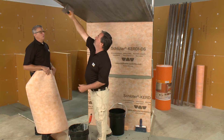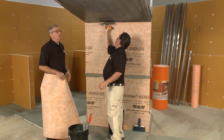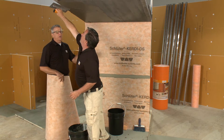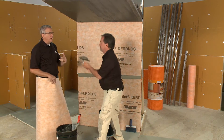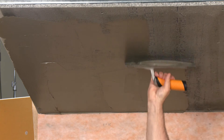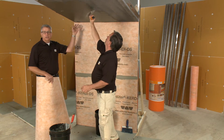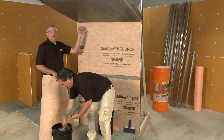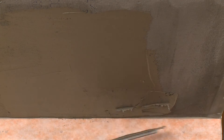It's always a good idea to use the flat side of the trowel first to really get a good bond to the substrate — burning the thinset into the substrate is good tile-setting practice, and it's very important here on a ceiling. When you get the thinset applied, whether it's a wall or ceiling, the last thing you do is turn the trowel around to the notch side and gauge how much you're going to leave. This way you avoid dry spots — if you spread it all out including notching first, by the time you get to the far end it might start to flash. So get the thinset out of the bucket, burned onto the substrate first, and then spread it out.